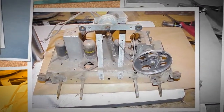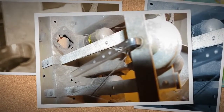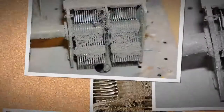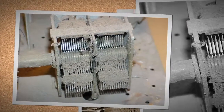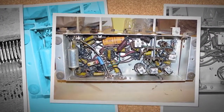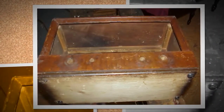The grill cloth was dyed, but not as well as I had hoped. Overall it will not look too bad. It takes a couple hours for the dye to dry, so we replaced the indicator dial cord. This is actually a simple procedure, and we are fortunate enough to have the dial stringing instructions.